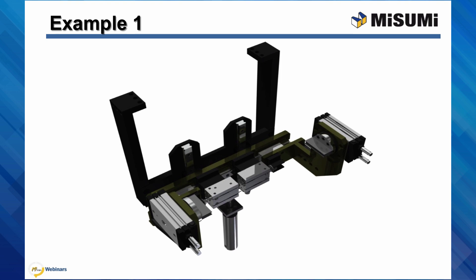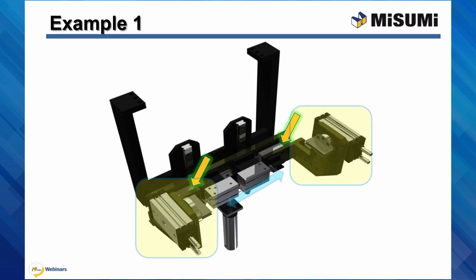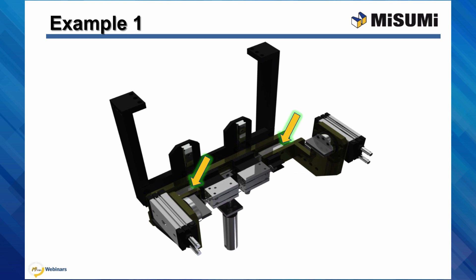The following are a couple of examples of how a linear guide can be used in an application. In this example, a mechanism uses two sets of linear guides. The first set allows the main assembly to move up and down; the second set allows for the smaller sub-assemblies to move side to side. Note that when utilizing linear guides, the rails must be supported along their entire length — linear guides cannot be used to span gaps. Also, linear guides should be avoided in applications requiring very short strokes. The strokes should be longer than the circumference of the ball bearing used in the system in order to prevent premature wear.